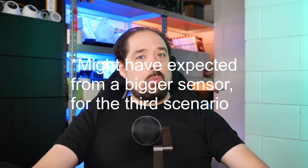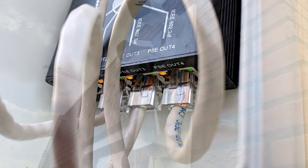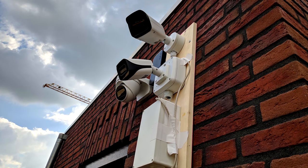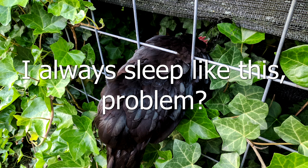To the third scenario, we're back in my garden. I basically just nailed the board to the wall next to the camera that was already hanging there, and I used a 1 PoE in, 4 PoE out switch so they could all run over the same cable. If you haven't seen my video about running multiple IP cameras over the same cable, check out my video about that subject. You'll probably find it there and also in the description. Here in the garden, we'll also have some moving subjects in the form of chickens. Chickens are always good, except at night, then they're sleeping. So let's first look at some daytime footage.